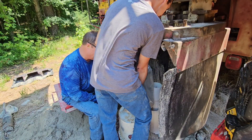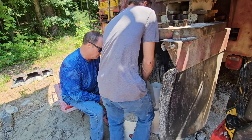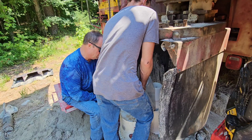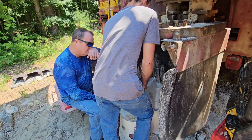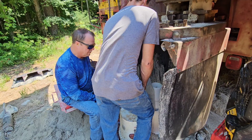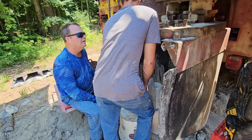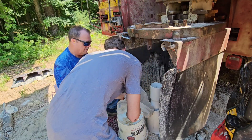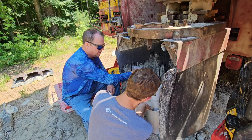I don't want to go too fast and create a bridge. Remember, we did this over on Tar River Road? It was a 400-something footer but that well had like a 380-foot static level. We blew it out thinking the well had collapsed, but it didn't. When we got back down to 400 foot the well made six gallons a minute again. That was me, you, Hudson, and Alex.